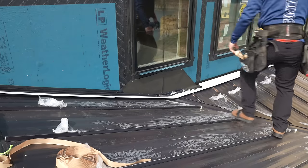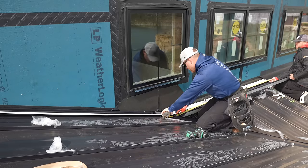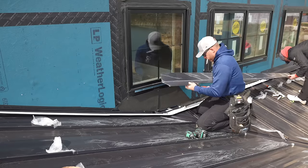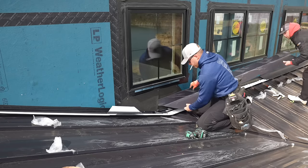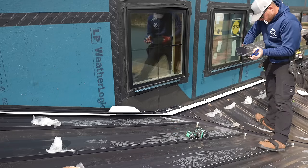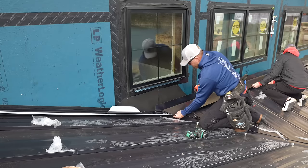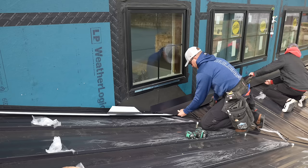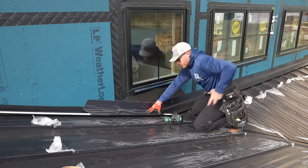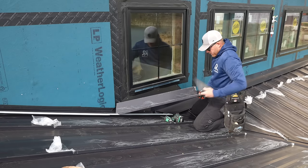Now that that's done, I'm going to go ahead and get this piece of flashing on here. Let's go 109 and a quarter — let's say 103 and a half. We'll put it on and see what we've got. To figure this angle out, I'm going to set it right at the point where I want it and then measure it at six inches, which makes sense because these flashings are six inches. So it should essentially be a six-inch miter of sorts.